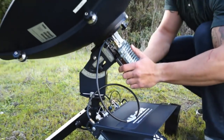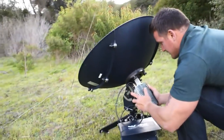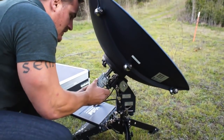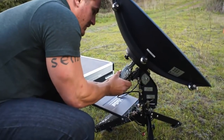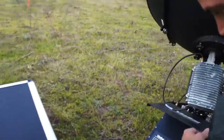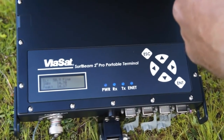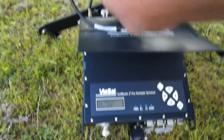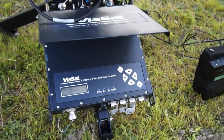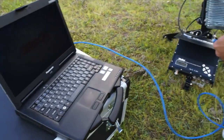So we're about six minutes in now. This is obviously the hardest part, and in a remote location like this your azimuth and elevation is really easy to point. You can see me adjust my SNR — right now our SNR is already at 14.51 dB, 14.7. We optimally want to be over 11. So I'll go ahead and hit enter, hook up the computer, allow the modem to range the satellite, and connect us to our gateway and force down the DHCP address.